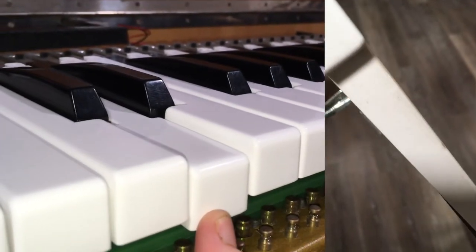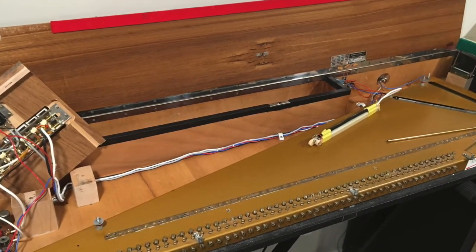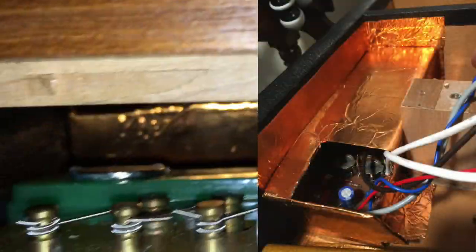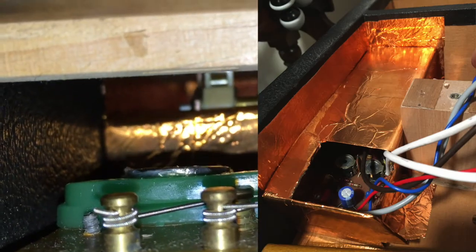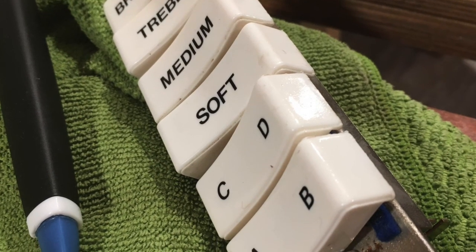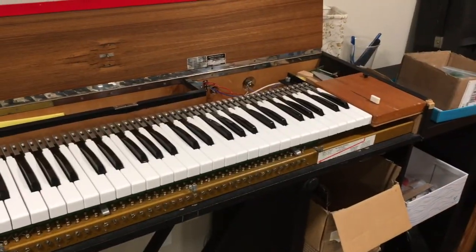We also did a nice big scrubbing of the keys. I did a full clean-out of the inside — since the harp had all the strings and gel removed, I was able to really wipe down that harp nicely, everything super clean. We also got the shielding box sorted out; I've gotten a bit of a system going building those now, and it's cut out so the switches get in nicely. I did a full clean of the switches too, just to make sure the contacts were good, and ended up cleaning all the controls on the whole thing.